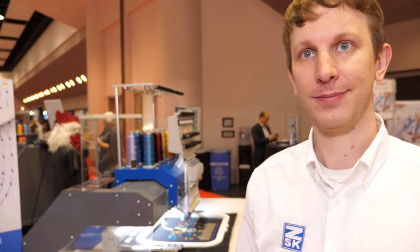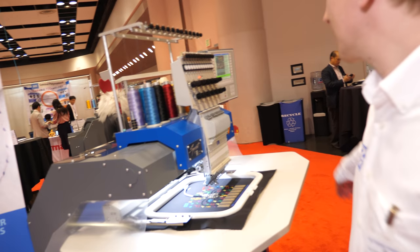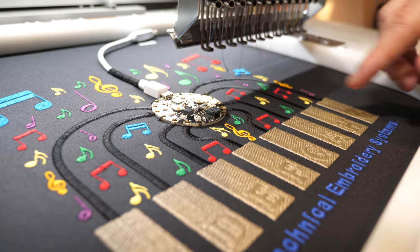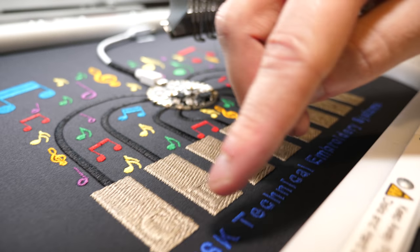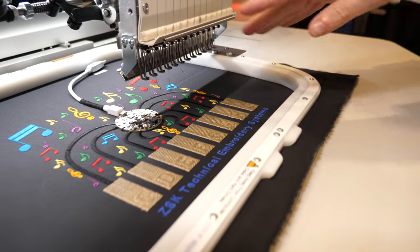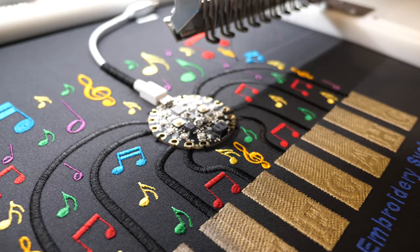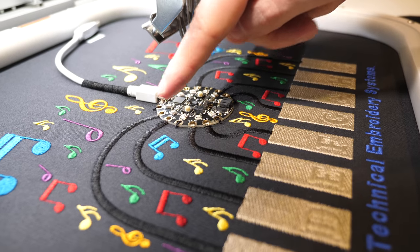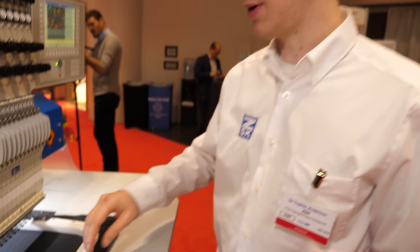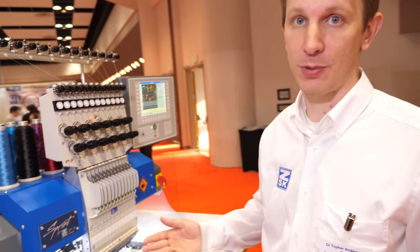We've converted a textile machine to work with all these sensors. What we have here is a capacitive touch sensor — a self-capacitive sensor — that allows us to detect the capacitance of a person touching it, creating a keyboard that somebody could play. We also have a conductive path that travels up through the individual e-textiles and is terminated and connected automatically through the board. We're trying to create a single-step manufacturing process to create the sensors, the connections and routing, and connect them automatically to the board so there's no post-soldering.